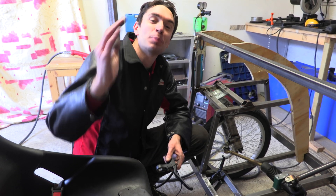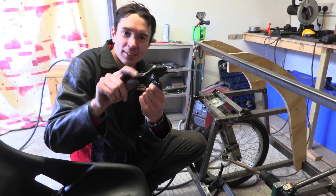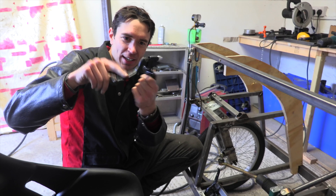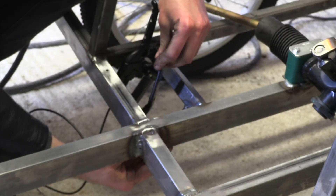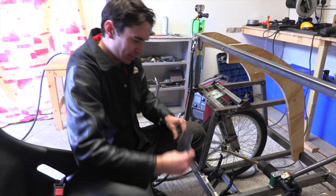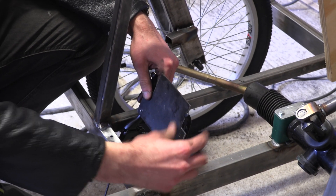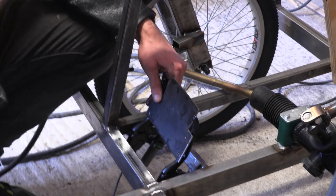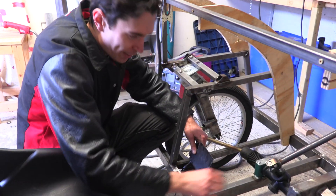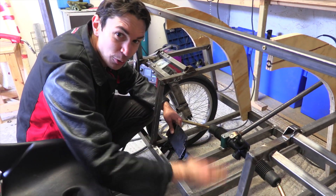We need a way to speed up and slow down the dog car. We've taken bike brake levers — two of them — to connect onto the steering column, and we've made a little plate that will work as our foot brake, mounting so we can use those two bike brake levers to control our rear and front brakes. Over here we're also going to put another foot pedal as our accelerator to control the speed of the vehicle.